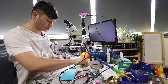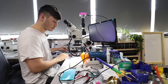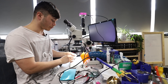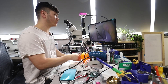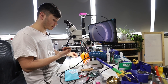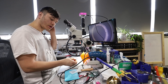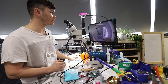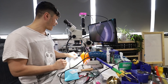We're dealing most likely with a card that has two BGA chips — either BGA 132 or BGA 152 memory components. This is the donor card that works; this is the failed card that doesn't. The failed device has to go through the process of reballing and then be mounted to the donor. I want to be as careful as possible — not damage the chip, not overheat it, and not apply excessive heat when pulling them out.